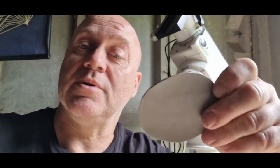Newtonian collimation. What we need to do first is center the secondary mirror. I've made a little bit of card that is the shape of your secondary mirror. It's usually tilted around about 45 degrees, so if I tilt that 45 degrees it becomes a circle. If it's not quite right, if it's not centered, it becomes ellipsoid — it becomes out of a circle.